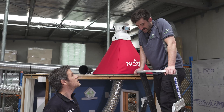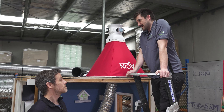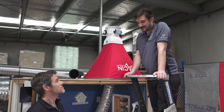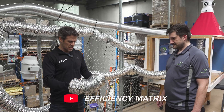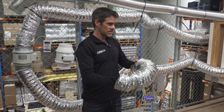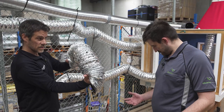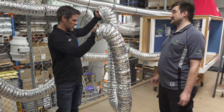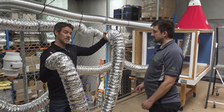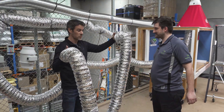Another common point — also impactful in other ways — is ruptures. You might end up pulling air from places you don't want to and dumping moisture in places you don't want to, creating condensation issues. Extra duct length just hurts, but it's super common to see an installation where just a little bit of duct is needed, but the installer uses the whole length because it comes in a kit. Instead of using just what's needed to connect the fan to the register in the ceiling, they just use the whole thing and all that duct gets draped there. I've heard people do that for sound because it makes it quieter — one reason it makes it quieter is because you're just not getting much airflow anymore. The duct losses are so bad that the fan just doesn't move much air.